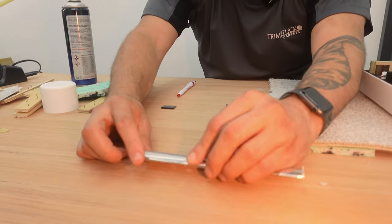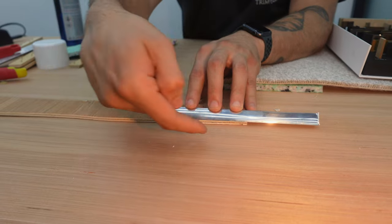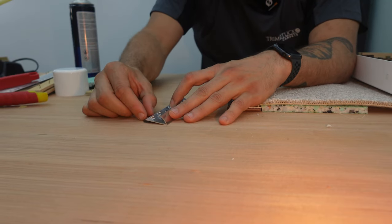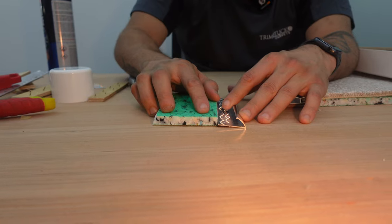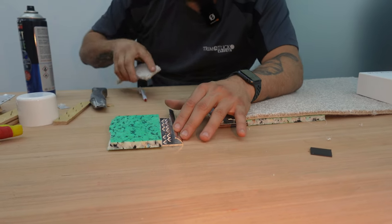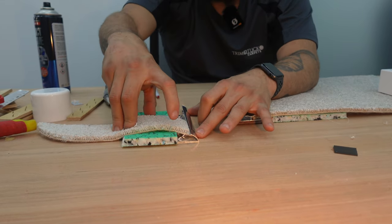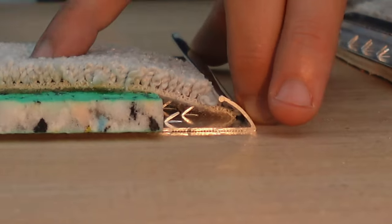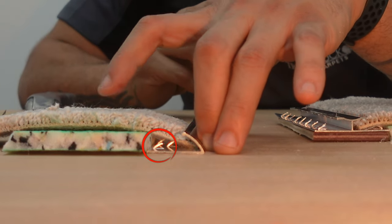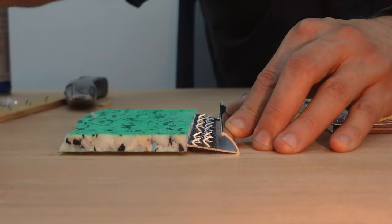With a single bar, you can't just raise it straight like the ply because you're going to see that edge from the opposite side. So this simple yet effective design allows it to ramp up. Now you raise the bar on top of the wedge, which lifts it up. Without that, you've got the same problem - the carpet comes in and dips in. From the side profile you can see maybe the front two teeth will grab it but the back teeth definitely won't touch it. The moment you raise it, it lifts the back and when the carpet comes in, it hooks onto it.